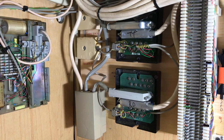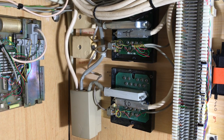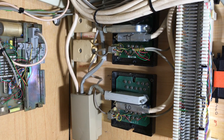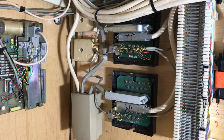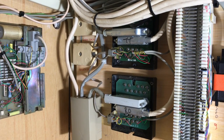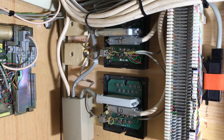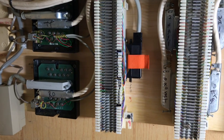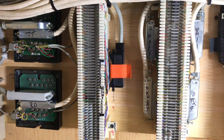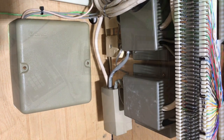Over here on the center of the screen are the two connecting blocks that the primary telephone sets connect to. The telephone lines wire to these two blocks and then there are cables that go off to the other phones. I have run out of space on my main IDF frame for cables, so I built a miniature IDF frame under the shelf where the ComKey phones are. The connecting block on the right side is where the 416 ComKey connects, and the block on the left side is a feed for all of the phones on this frame. Here is the finished product with all of the covers on.